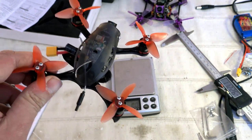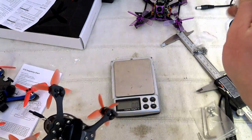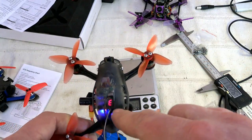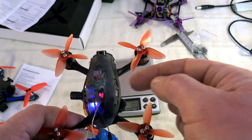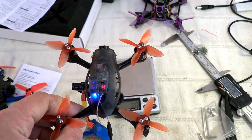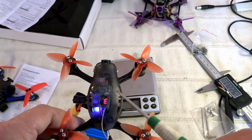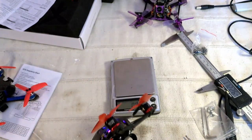By default, it's transmitting at 200 milliwatts, and as soon as you plug the battery, you can see an H displayed, meaning high power, okay? So let's power it. We have it here already pre-tuned on E4, and when you tune, press this button, you will also see an H displayed to say high value, so 200 milliwatts. I regret maybe that the output power is not also displayed along with the cycled frequency band and channel. This information could be very important, whatever.